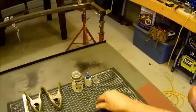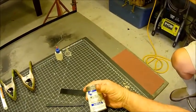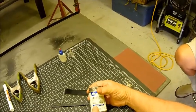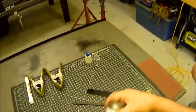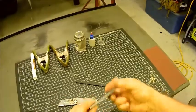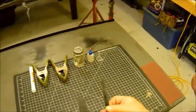What you're doing is you're not gluing it — you're actually using methylene chloride, which is good for polycarbonate and styrene. This is nothing more than methylene chloride. This is a syringe bottle you use to weld it with, and a little funnel. So after you score it and break it, it looks like this.